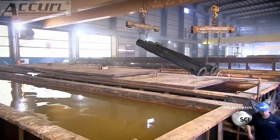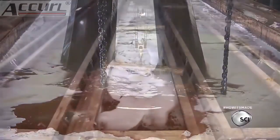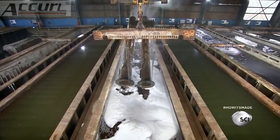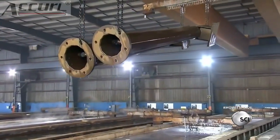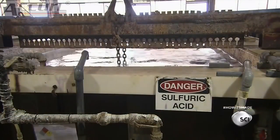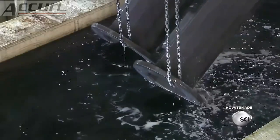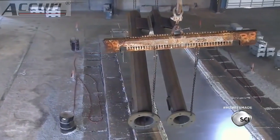The factory ships the finished poles to a galvanizing plant, where they're dipped in a series of wash tanks. The tanks are deep enough to fully submerge the poles, so they can treat both the inner and outer surface at the same time. The poles then go into a vat of sulfuric acid, which dissolves the more stubborn contaminants that washing can't remove. The next tank contains a chemical that weakens the surface of the poles, allowing the galvanizing metal to penetrate the steel rather than sit on the surface.